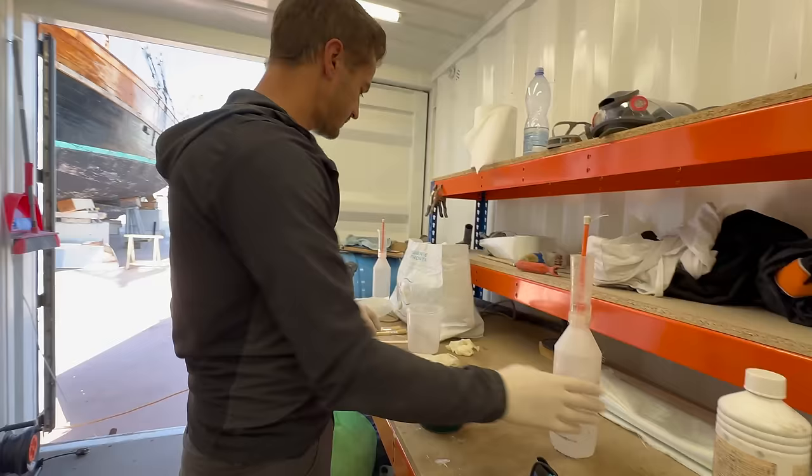So, it's been a while since we did glass. Glass it up, buttercup. Let's do this. Just pour. Probably should have used the... it's blue. Yeah, vinyl ester, it kind of turns green. Smear it around. I'll mix up another batch while you're using this one. Start wetting. Pick it up a little bit. Slide it towards you. Slowly, slowly, slowly.